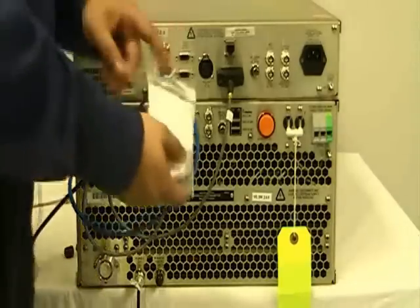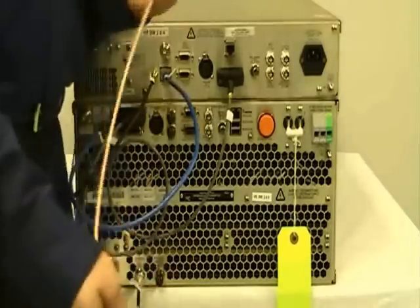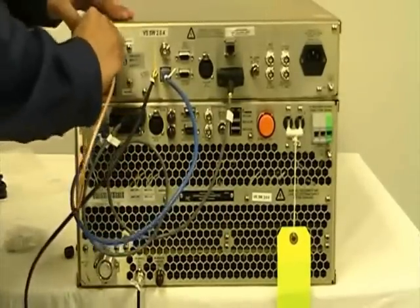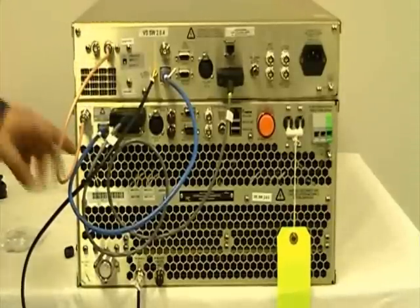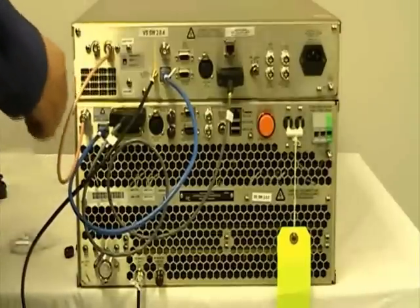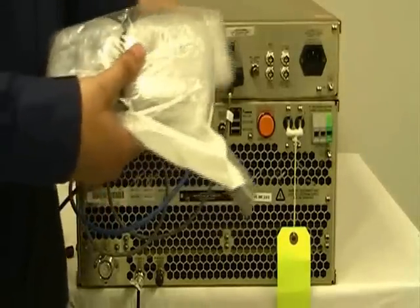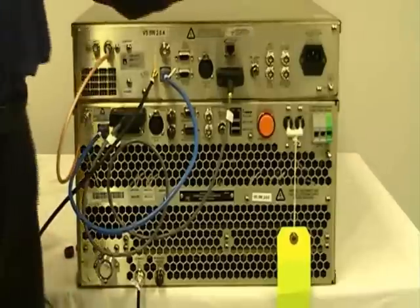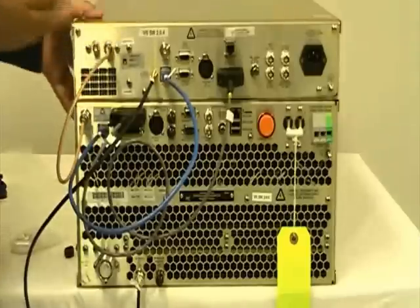Nautile provides the crimps for your RF outputs, but we do not provide the cable. However, for the purpose of this demonstration, a cable has already been completed. Enter the RF output from the VSHD into the RF in external that we have already prepared. All cables that enter into the transmitter should have ferrites attached to them to ensure that RFI does not enter into your system. Complete any other commissioning processes that are required, such as power, and any other audio connections that you wish to install. And your setup is complete.